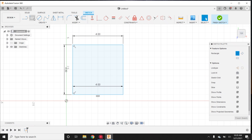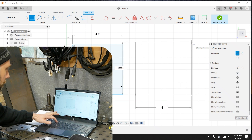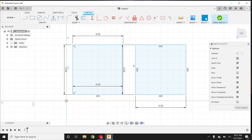We've got our box — that's one way to do it. Or we can come over here and hit the two-point rectangle tool and draw another one. Fusion 360 has some cool features: if you find a corner or a line, it will give you this grid work so you can stay in the same plane with it. So we're going to draw another part right here. With the two-point rectangle tool, we hit four and that sets one dimension, then tab takes it to the other — we hit four again and then enter. Now we've got a box. These black lines with measurements aren't actual drawing lines; they just represent the measurement and you can grab them, left click, and pull them in, out, or move them around.